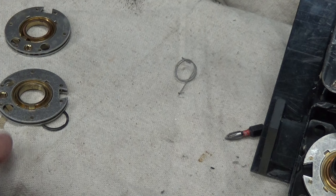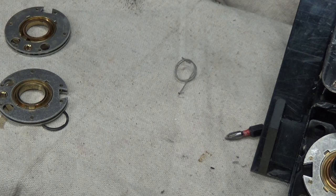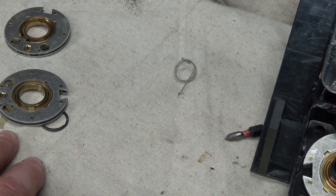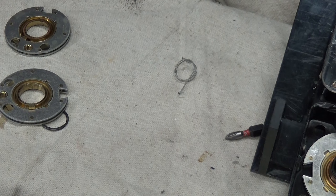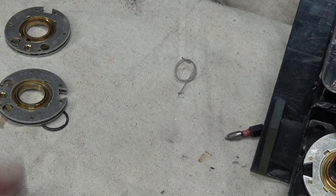So sometimes it's an unlocked wheel, sometimes it's a broken fly, and this can all be figured out by dialing diagnostics — meaning you don't have to have the door open. I just spin the dial and feel for what's going on in there. Basically you park all the wheels at 50, then go to the opposite direction and snap that dial 10 before the number you parked on — in this case, to 40 — snap it in the same direction you're going, and you should feel that wheel pick up. You can do it again to pick up the next wheel. If it's a four-wheel lock that'll also tell you how many wheels are in the pack — good to know if you don't know what's behind the door.